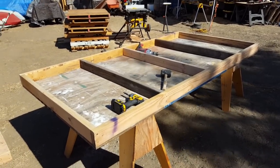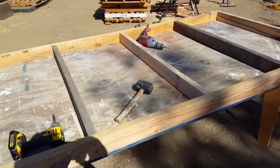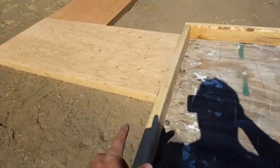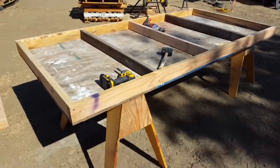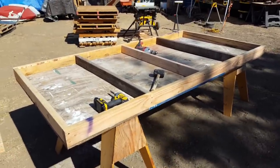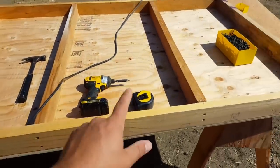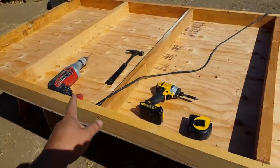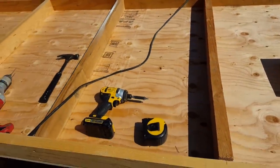These are going to be the three decks we're making this year for the facade — a 12 by 16. I'm adding two by fours in here. We try to reuse what we have: this plywood piece was actually the table we were mixing mortar on. We did have to buy two new sheets. The two by fours are actually discounted lumber — two by sixes we ripped down to two by fours, 75% off. This is a four by eight deck with three-quarter inch plywood, two by fours using three-inch screws, pre-drilling on the outside two by four, spaced on two-foot centers.